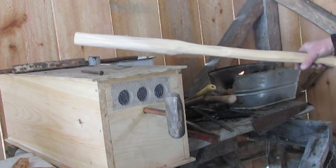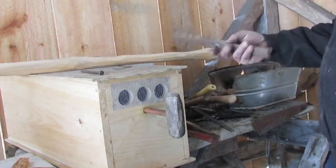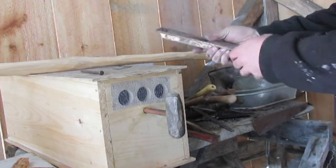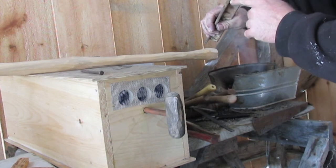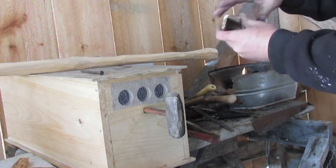What I decided to do — I have this scrap piece of quarter-inch angle iron, and I think what I'm going to try and do is flatten it, and I think that'll give me kind of like a diamond-shaped cross-section, because it's thicker where they sort of upset the metal to fill that corner.